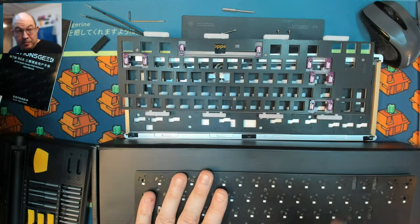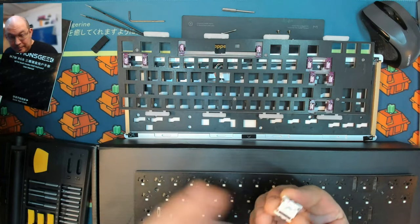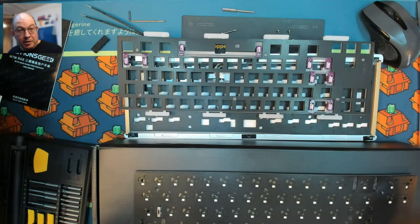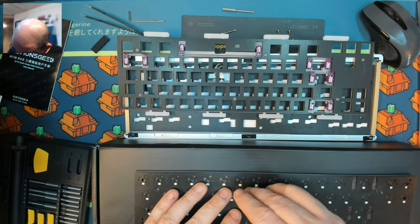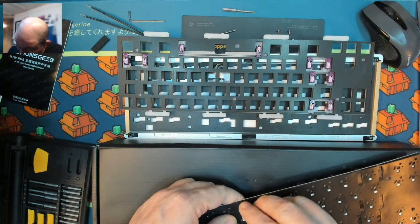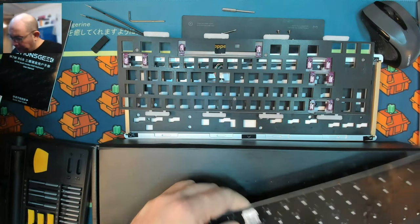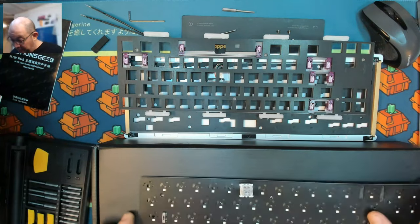All right, so we've punched out the middle pin, or basically the stud in the middle, that big rounded out one. If we're planning to use three pin switches, that's all you gotta do. If you know you're not gonna use any 5-pin switches, you can actually just go ahead and use the pins from a 3-pin switch, make sure they're straight, and it'll punch through the holes for the pins. It goes right through, and if you do a close-up, you can actually see the pins in there. I've tried this several times, and I've not had issues.